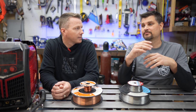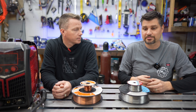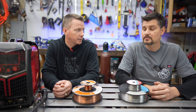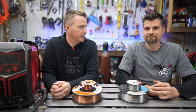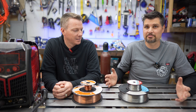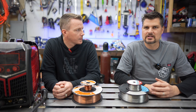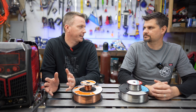Number four: it's not great for outdoors. Any type of wind that comes by is just going to blow the shielding gas away, which defeats the purpose of the MIG weld — the gas is there to protect the weld. So it's not ideal for outdoor situations; it's quite sensitive to any wind or air movement. Another disadvantage is your metal. MIG is kind of a picky process — your metal needs to be clean. It doesn't like rust, doesn't like paint. Typically indoors your metal is already slightly cleaner and it's easier to have the stuff around to clean it up.